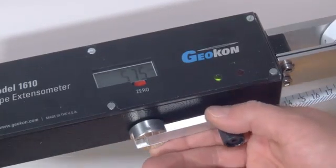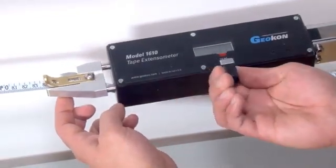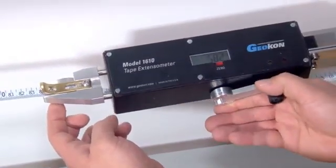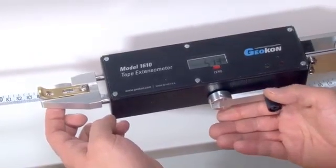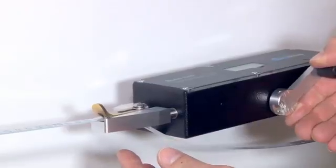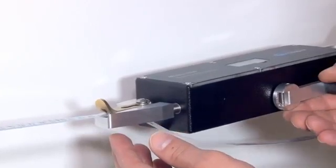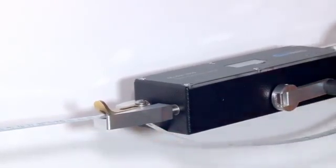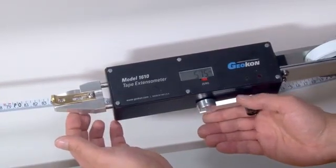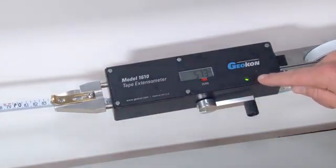at rest and untouched. Place a finger under the tape in front of the instrument. Gently lift the tape to ease the tension being applied. The green indicator light should go off. Removing the finger will cause the green indicator to illuminate again. If the green indicator light stays off, turn the tensioning handle in the clockwise direction to reapply enough tension for the green indicator light to go on and off with gentle lifting and releasing to the tape with your finger. The tape is now correctly tensioned.